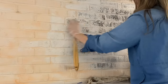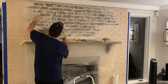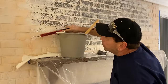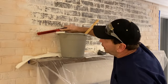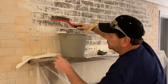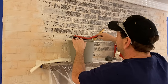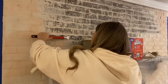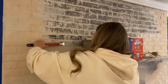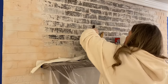There is the grill brush — that was my favorite one to use. We also found that using hot water really helped loosen the paint, so we were dipping our brushes and the steel wool in really hot water and then applying it on there, and that really seemed to help. I liked using the steel wool because I could make sure I was getting the look I wanted without taking off too much paint, because I really wanted that German schmear look. I had to run to Lowe's to get another can of the stripper, and while I was gone Wayne did a little bit of work too.